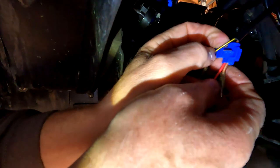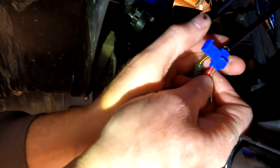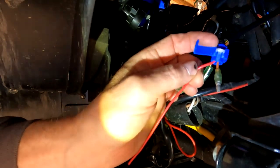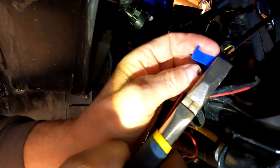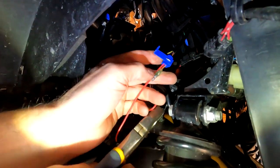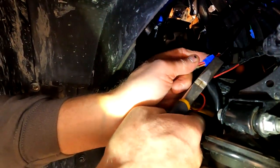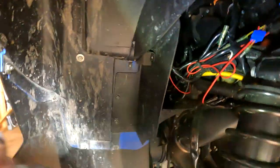I'm going to push the red wire up just a touch, then move the black-and-yellow wire out of the way and fold it over. I'll clamp it down, making sure the red wire is tucked up nicely, then pinch it down so it makes contact for both wires — crimp that down nice and tight. Now I just fold this over to close it up and pinch with the pliers. I'll come back later and tape around there.